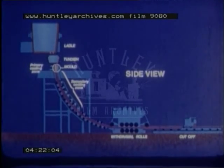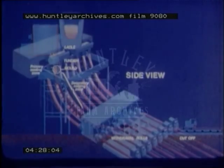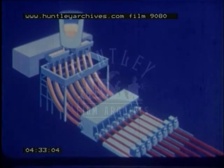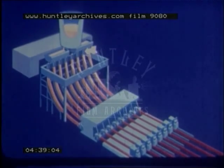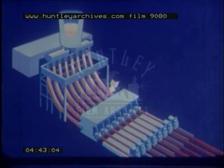For simplicity, we've been looking in side view at the plant arrangement for a single strand. If the apparatus is turned through 45 degrees, we can see the actual arrangement in the bloom casting machine. One ladle and two tundishes supply eight moulds and produce eight strands simultaneously. These strands may be of several different sizes to suit the final product mix.